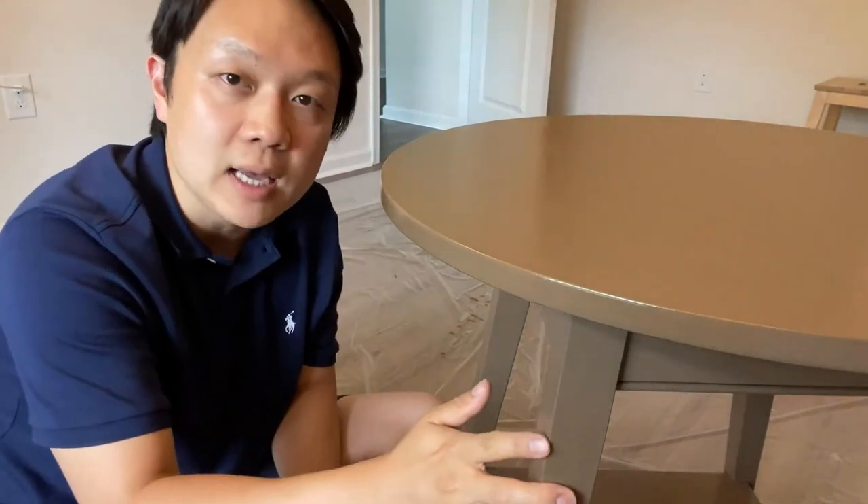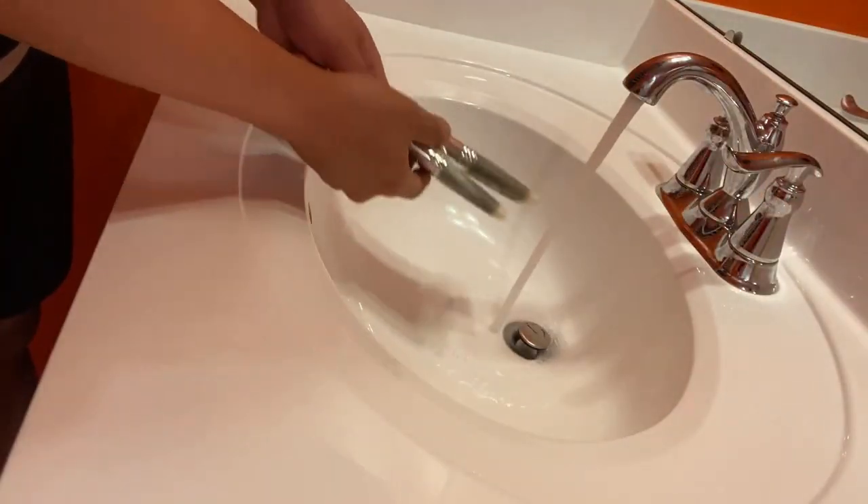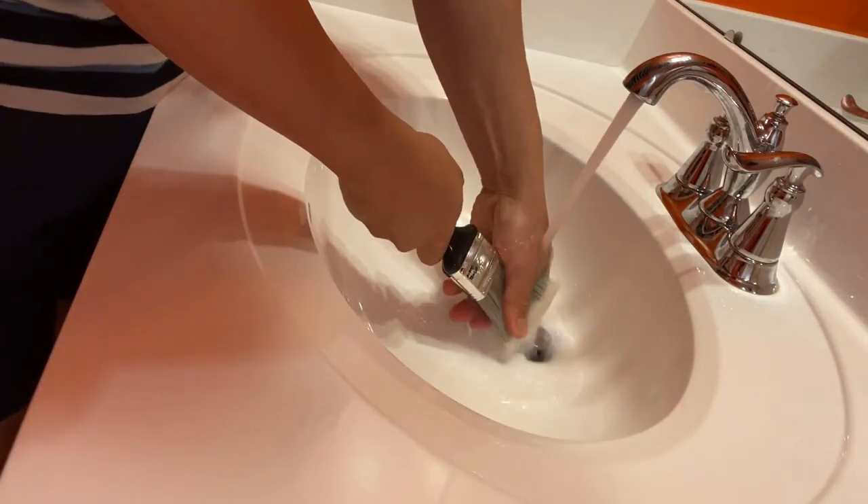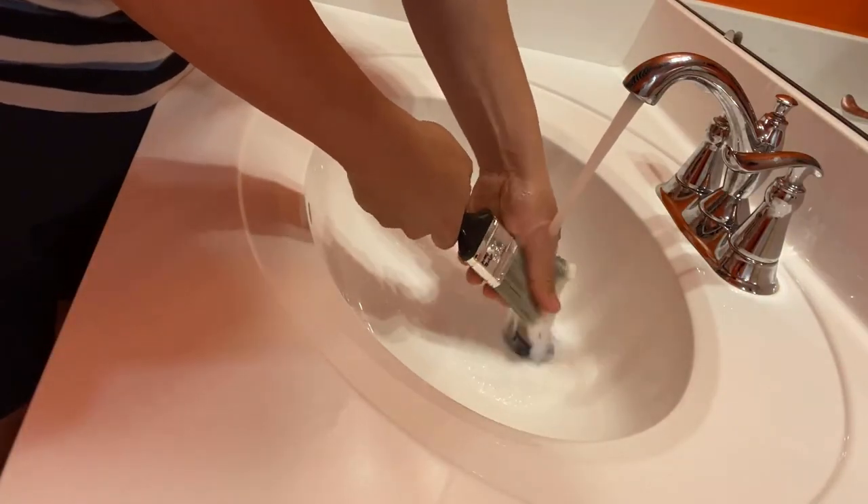Okay so this is the finished product. For the very top surface we ended up doing three coats of finish, and for the legs and the sides we did two coats, and for the underneath we just got away with doing just one coat. I also have to mention that this polycrylic finish is a water-based finish, which means that the cleaning up can be done with water, which is really easy.